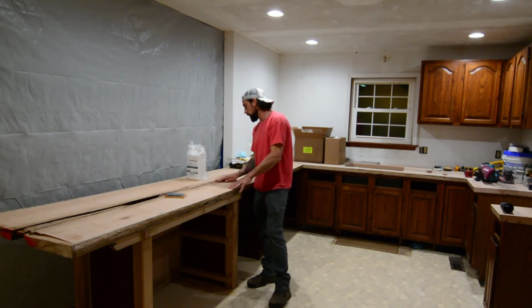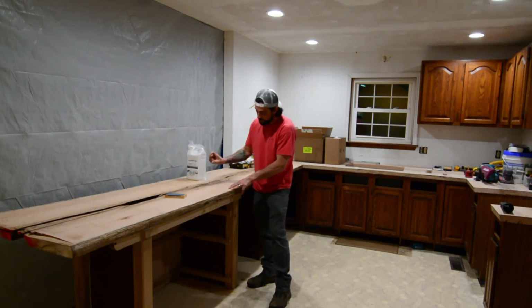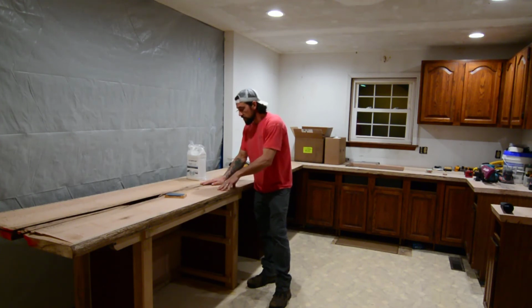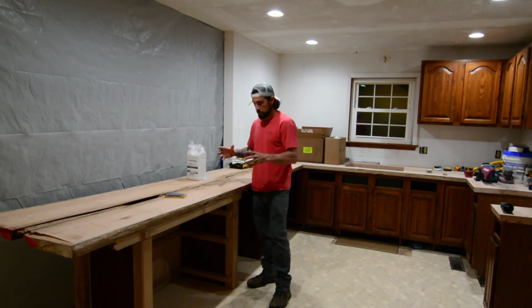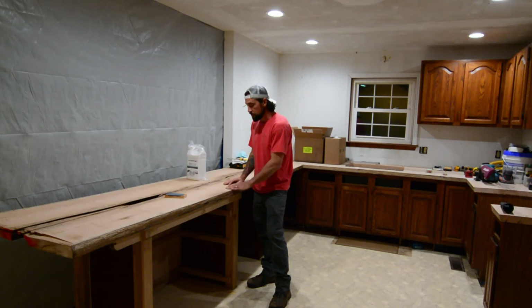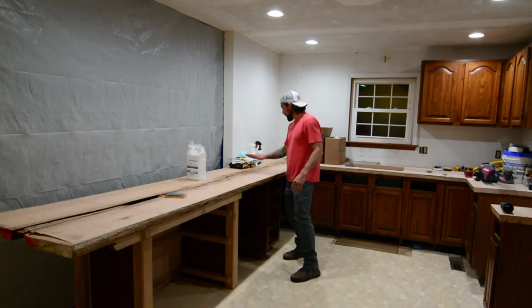And so what we've done is we've installed the bow tie inlays. Now these are a full 1.5 inch thick inlay that goes into this 2 1/4 inch slab. So it goes almost all the way through the whole slab, and it will be plenty big enough to hold this big crack together as this wood wants to expand and contract with temperatures and humidity. The other thing is that the epoxy fill is going to bond everything together too, so we didn't have to go with a full bow tie all the way through. But we've got our inlays done.